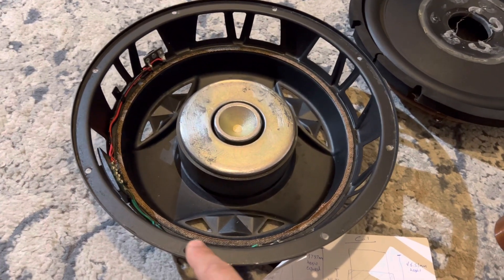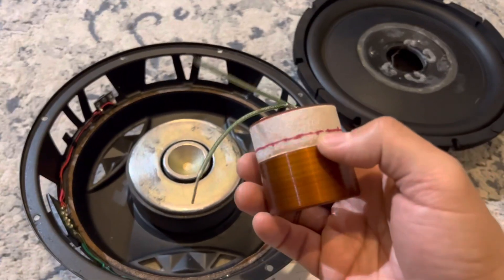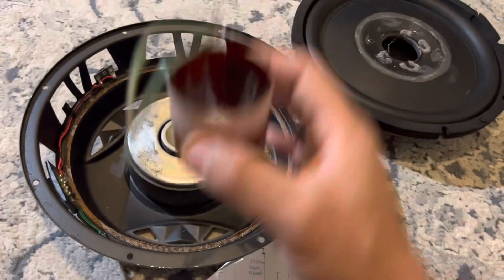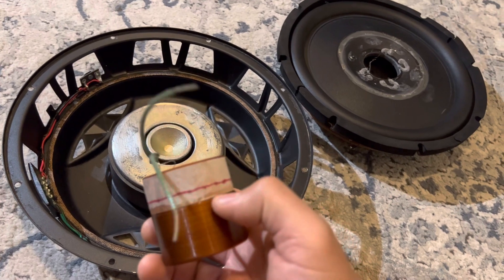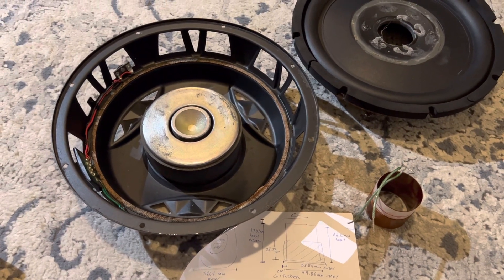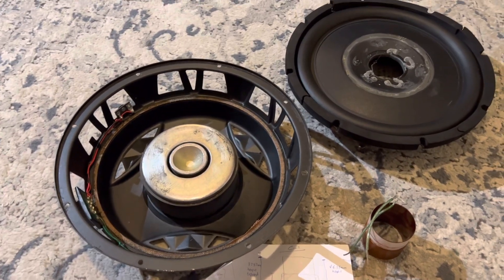I'll also be adding the surround - I'll have that in the next video. For the voice coil installation, I'm going to use five-minute epoxy to hold the coil to the cone - you don't really want to use RTV here. The five-minute epoxy is very strong and this is a hard pressure point that goes up and down consistently holding the cone in place, so I like using good adhesive both from the top and bottom of the assembly. Stay tuned - there's an afterlife for these subwoofers. Not all of them can get repaired, but for the majority, if you put your mind to it and a little bit of TLC, you can get these up and running.